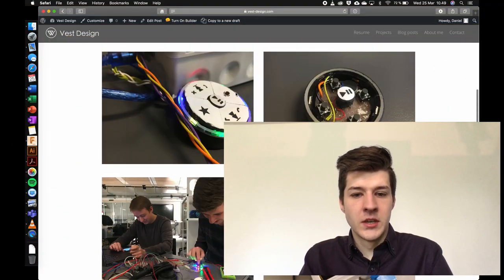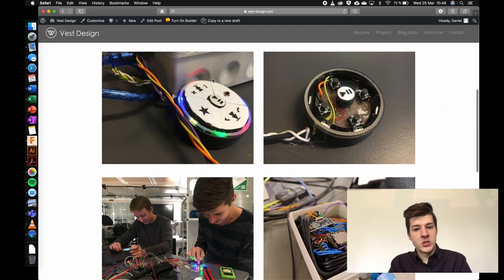What we're going to make today is one of my projects. During my engineering project I built one of these small cells with basically four buttons, a NeoPixel ring, and a vibration module. I built it from a prototyping board and would like to see it built with SMT components in a better form factor. Cutting it out in a circle was also challenging, which is why we want to do it on a CNC.